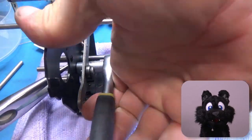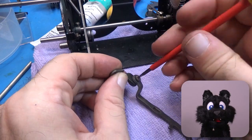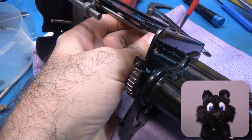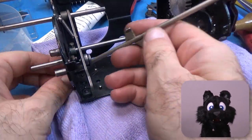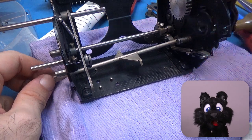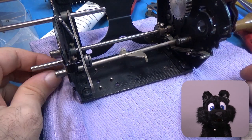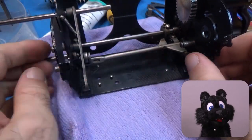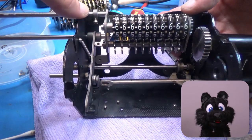Another reason why everything in here is so complicated is also another feature from the product fact sheet. Complete interlock. That means that you can only use levers and the crank if the current state of the clockwork agrees. Unless you use brute force, the device makes it impossible for you to end up in a jammed state. And all these interlocking levers and springs are adding to the complexity.